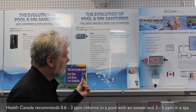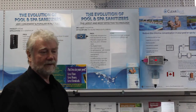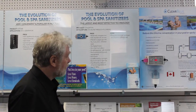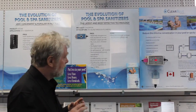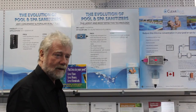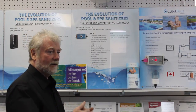What we recommend to all our customers is basically put an ionizer on your pool. It's about half the price of a salt system. You don't have to be lugging these big bags of salt into your pool every year, and you don't have to worry about pH balance. With something like the Z-POP that we have, which has zinc in it, the zinc helps clarify the water. You drop one into your skimmer once a week on a large pool, once every two weeks on a small pool. It builds up copper, silver, and zinc in the water itself.